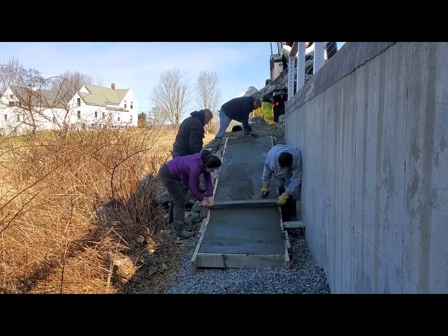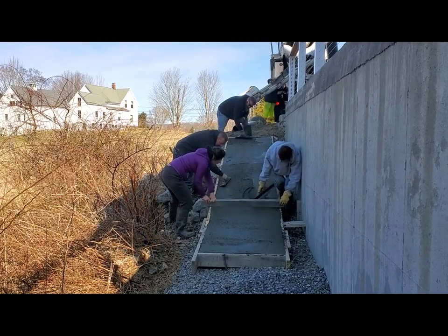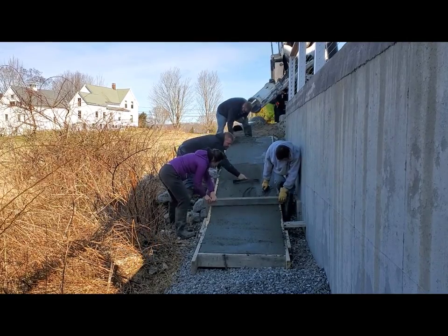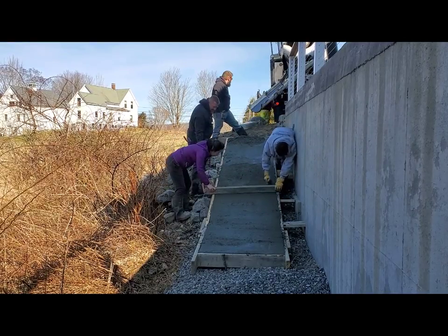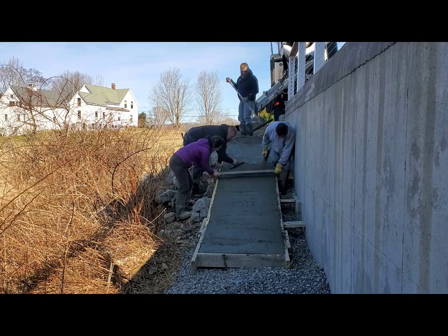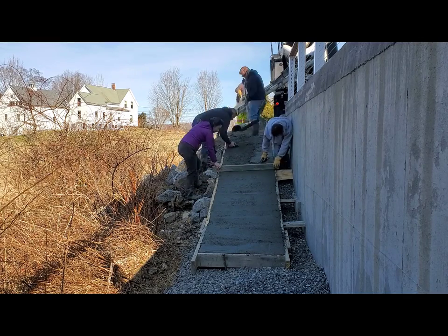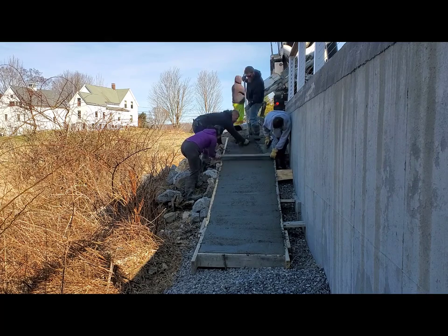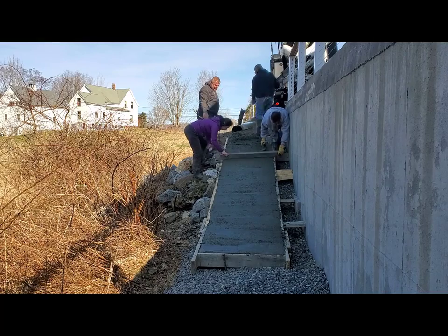It's not going to have any trouble shedding water, so that really wasn't an issue. It's a pretty tight squeeze in that one-foot area, but I made it all right. We always screed concrete uphill when we have a ramp like this — it just doesn't want to sag as much. You've got to pour it pretty dry, probably around a four-inch slump instead of our normal six-inch slump.